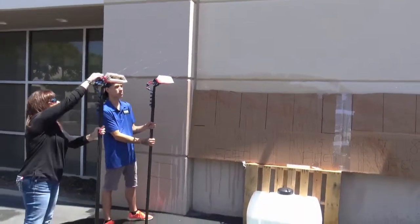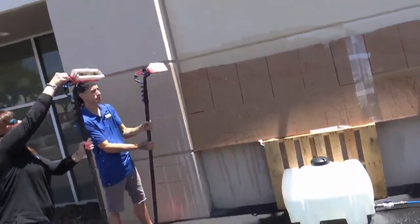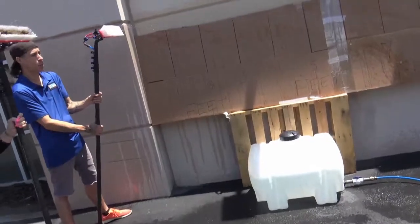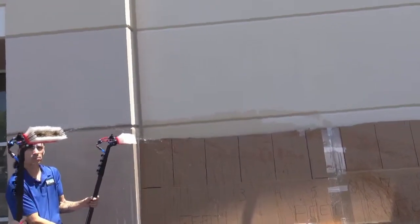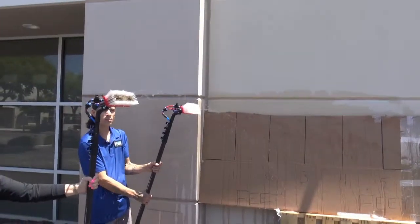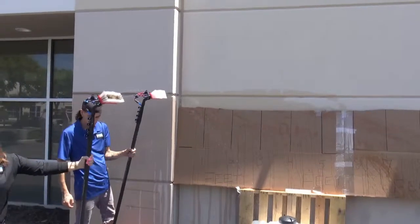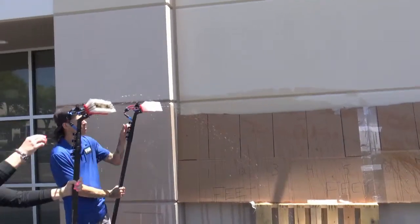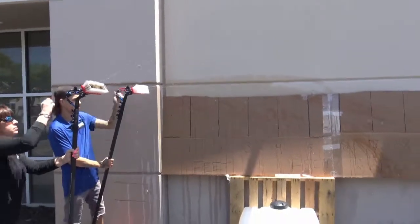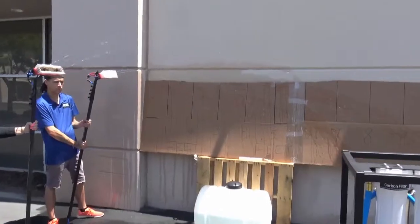Now with the rinse bars on both poles, you're going to be limited here. We're talking about two water-fed poles with rinse bars — they aren't actually functioning the way they're supposed to work. That's what you're going to get out of a single RO unit with no pump. So turning those rinse bars back off — that's two poles on tap pressure.